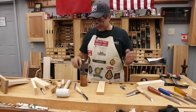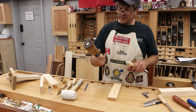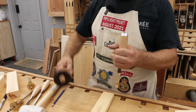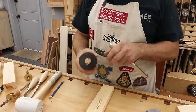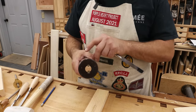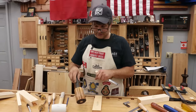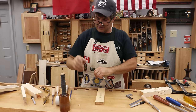The next tip is personal preference, but there's a little method to the madness. I prefer to use a round carver's mallet. A hammer-type mallet is too easy to glance off one side or the other, but with a carver's mallet I never miss — I don't even have to be looking at it. I also want it to be a good solid piece with no rubber on it. I want to deliver all of the impact, not absorb it. A solid mallet gives you good feedback so you can tell whether the chisel is doing what you want. With a good carver's mallet, you can hit over your head, you don't have to look, and it always seems to strike just where it needs to.